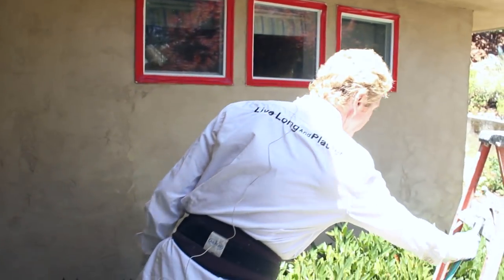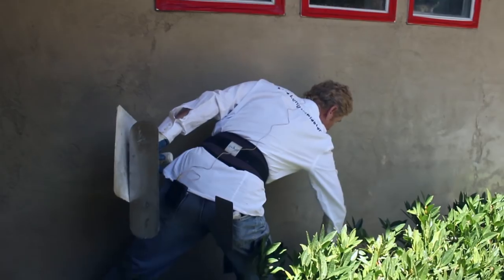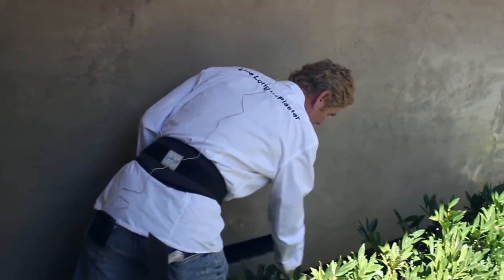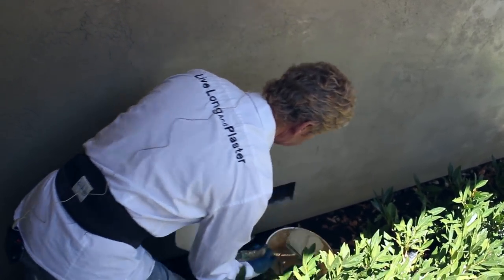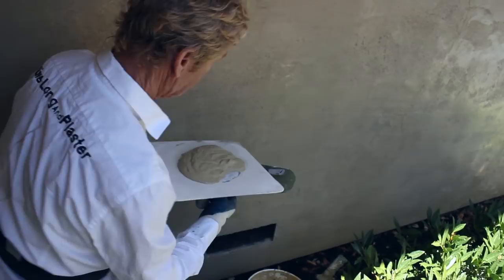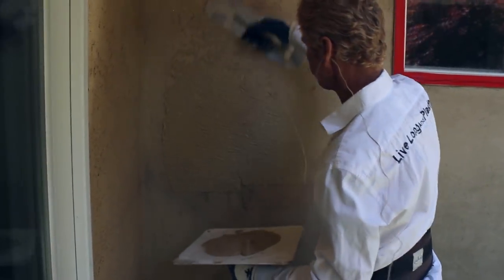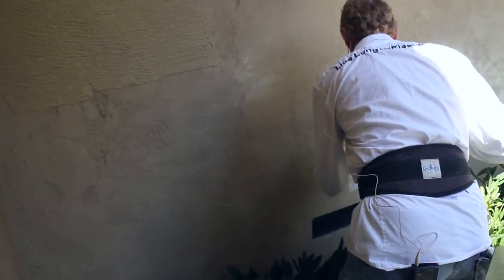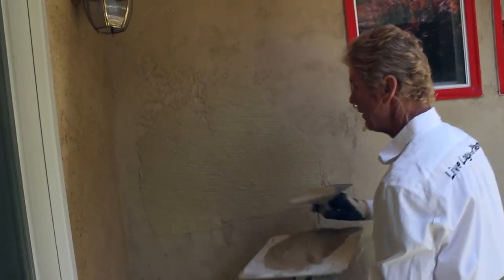You take your color coat material. There are so many different color coat manufacturers — La Habra, BMI Western, Omega — and what I have here is just a color coat material. This is sandstone X86. So we apply it. Remember, paint dries darker, and cementitious finishes — whether it's rock, concrete, sidewalks — dry lighter. The wall is a little wet here, but nothing I can't handle.